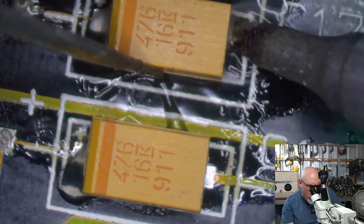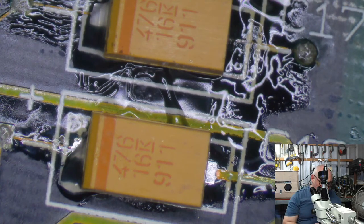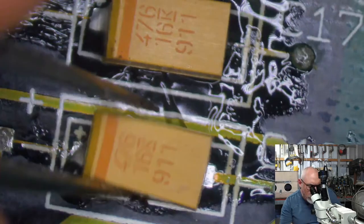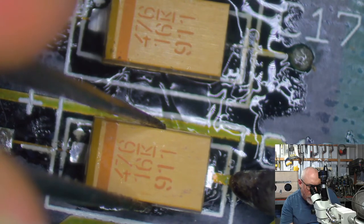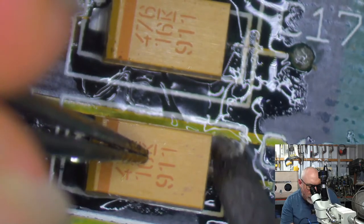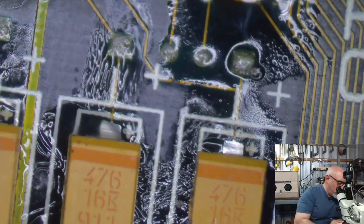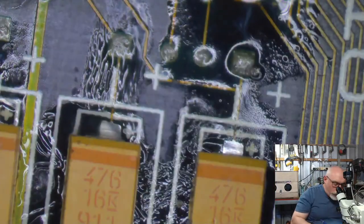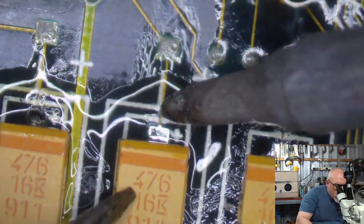What I also use that G5 for is copying stuff to the SD cards for my SCSI to SD. So if I want to transfer something to one of my SCSI to SDs nice and quickly, I can just take out the SD card from the SCSI to SD, plug it into my 10.5 or 10.4 G5, and just copy stuff straight to it. Can't do that on the modern Macs, unfortunately, because they won't write to the old Apple HFS file format. They just won't do it.